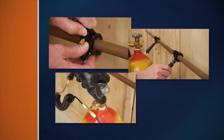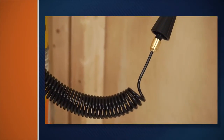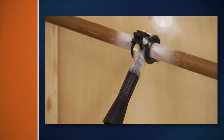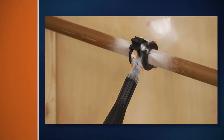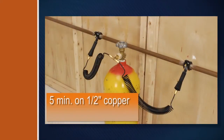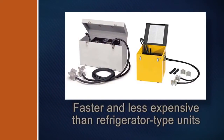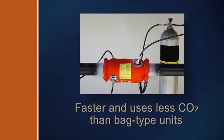and open the cylinder valve. Liquid CO2 flows into the freeze head — it's so cold it forms an ice pack in the pipe that can withstand 7,000 PSI. In five minutes you'll be ready to work on half-inch copper tubing, or in just three minutes if you're working on cast iron pipe. The Cold Shot works faster than refrigerator-type units and is more compact and less expensive.